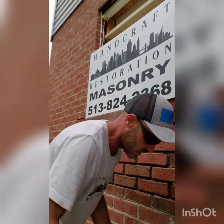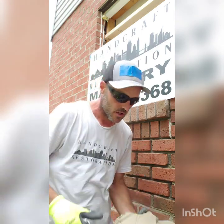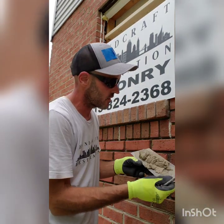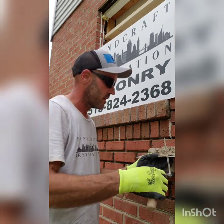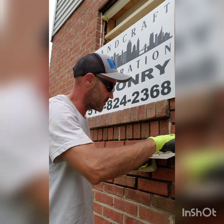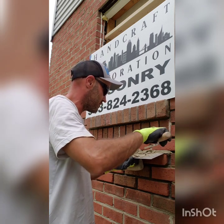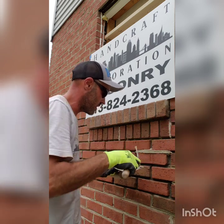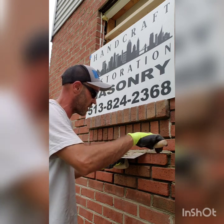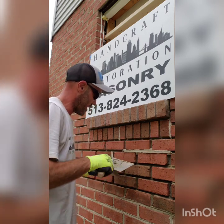I always start out with my bed joints. Another thing with the ramp — I like to use it on this edge too, because you don't want to get your mortar all gobbed up against the brick. You just want to take a little bit at a time, not putting whatever you're using to hold the mortar inside the joint — just put it right on the edge, and then take a little bit at a time and smash it in. If you're right-handed, go from right to left. When you're smashing it in, use your tuck pointer to hold that mortar in there as you slide your trowel over, so you don't pull it right out — because it will do that.